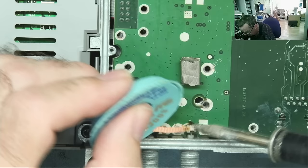220-25, let's measure it. Okay. Only reads 85, should be 220. We'll check the ESR in a minute. This one and the other one are 680-25s. Let's have a look. 120 out of 680. Not good, yeah. This one. A little bit worse, okay.